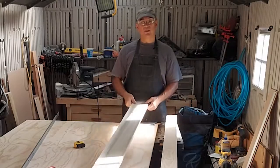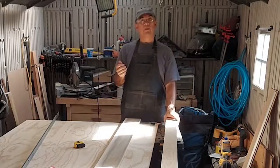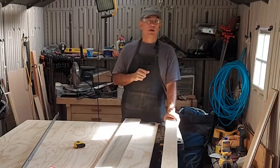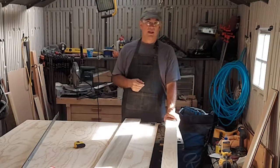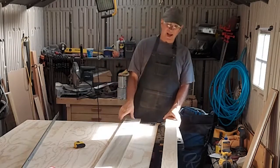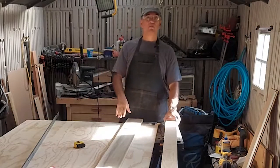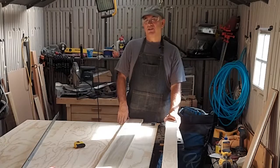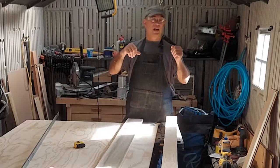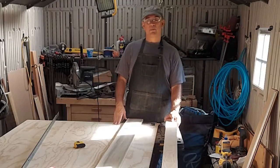Once I'm 1.5 inches thick, I'll take this poplar and cut a little over 1.5 inch strips off of this, and I'll glue them to the now edge, and I'll have the poplar rise just above the top surface of the desk itself, because then I'll just go around it with my trim router and make it nice and smooth. Once I do that, I'll go back and do a quarter round on both the top and the bottom of my now poplar edge, giving me a full rounded bull nose on it. There are a lot of nicer edges that perhaps we could do, but this is the most functional. I don't have any sharp edges if I'm leaning on it or have to worry about dinging corners. It just gives me a nice round edge, and I think that's going to come out pretty good.